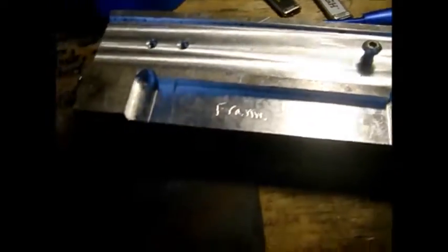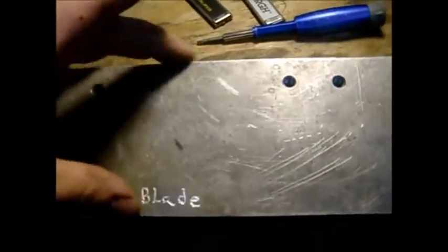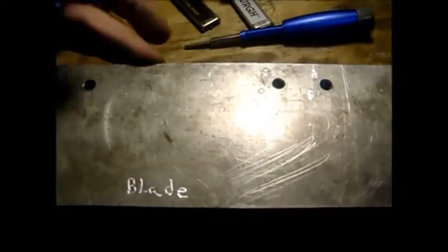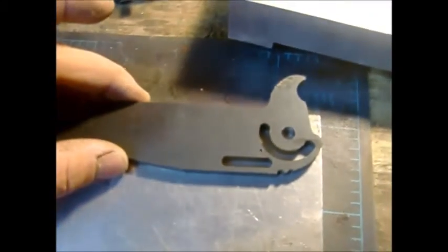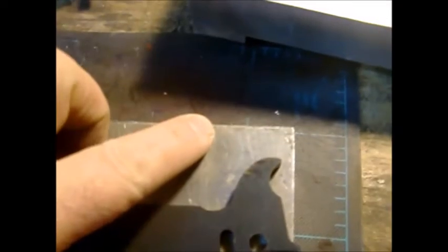I'll have to do it a little differently from this one because these ones have a flipper — obviously the War Horses didn't. On the War Horses I did it just a bolt hole and lined it up flat with the top. I kind of didn't like that because it was a little harder to get it perfect every time. So I'm gonna put a little lip, but then I'm just gonna knock part of that lip off to account for the flipper on the A-10 and the A-15.